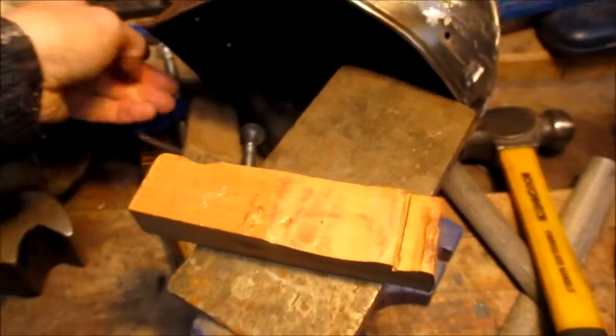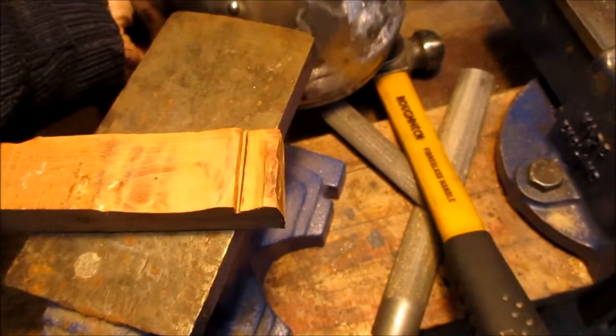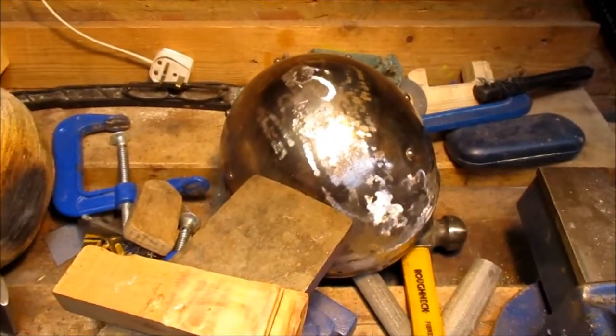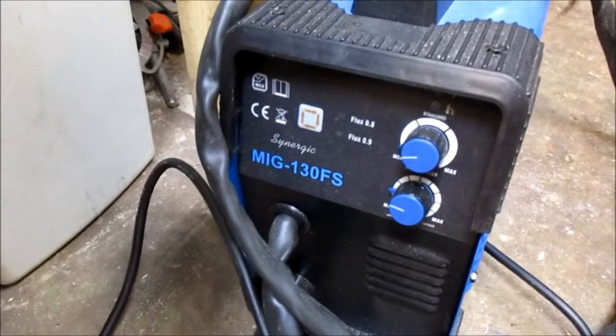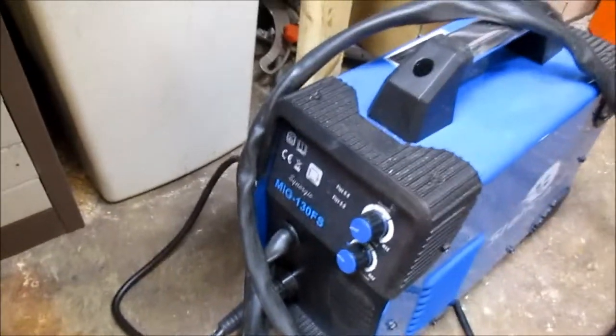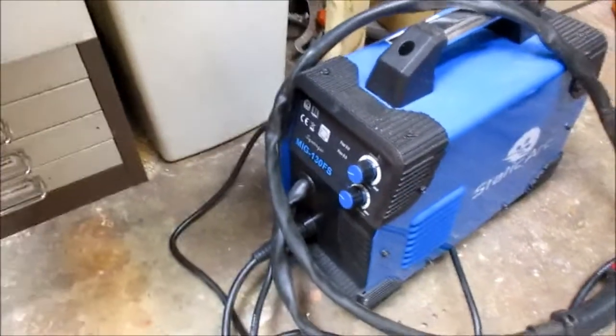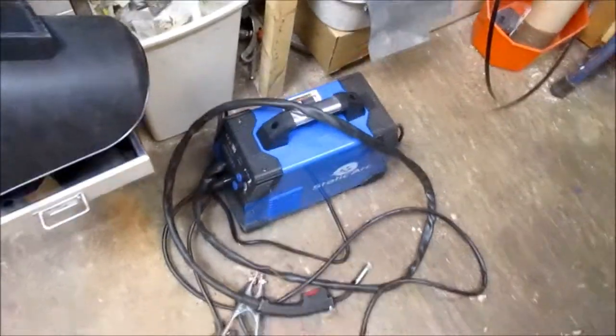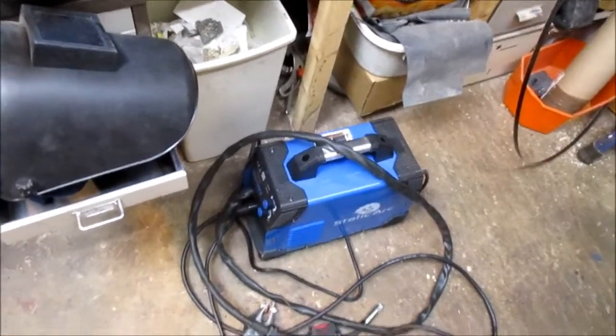If you're looking at doing a bit of home welding, that little MIG welder is absolutely brilliant for home use or hobby use. It uses IGBTs — basically fancy heavy-duty semiconductors — to rectify and chop the incoming mains without a great big transformer, so you can pick it up in one hand very easily and it does the job quite nicely. Probably wouldn't do for professional usage.